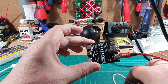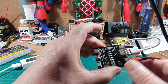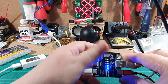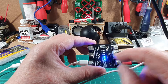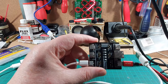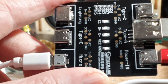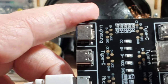Nothing's happening yet because there's no test cable. Let's use the power-only cable and put it into the micro USB slot. We've got blue LEDs this time, and as you can see only two are illuminated. Zooming in, we can confirm we've only got VCC and ground connected — so this confirms it's a power-only cable.